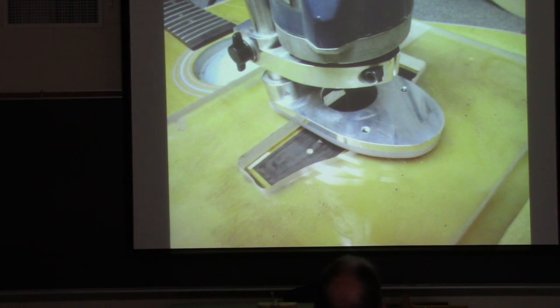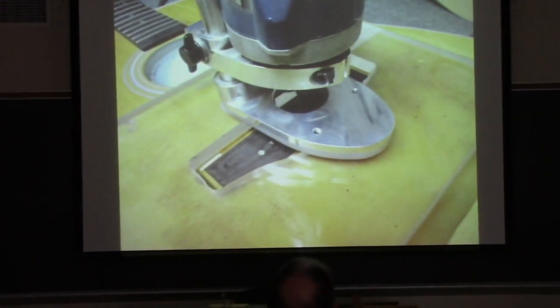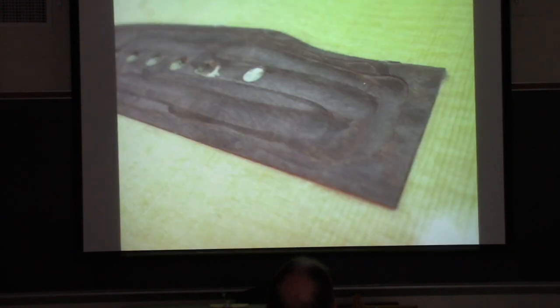So this is just a laminate trimmer with a little router base, a 1/4-inch bit, and I step down little at a time, and I get to maybe 20 thousandths or so. When you get down that close, it's pretty hairy because each time you're doing it, you're checking to make sure your router base is tight and it's not going to drift down anymore. But that does allow you to remove the bridge.